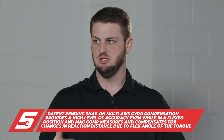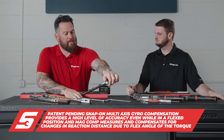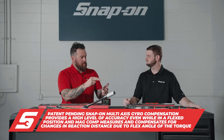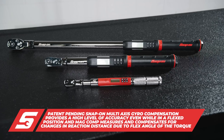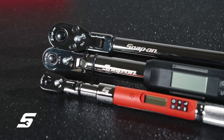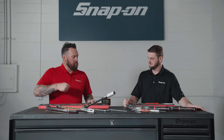The ATEC is great for suspension work, and especially engine work where you need to be very accurate. You can do torque-to-angle, batch counting, sequence counting, and more. It's also sensory overload compared to a signature click — you get vibration, you see the lights go on, and you hear the audio go off. Three ways to indicate you've hit your desired torque spec.